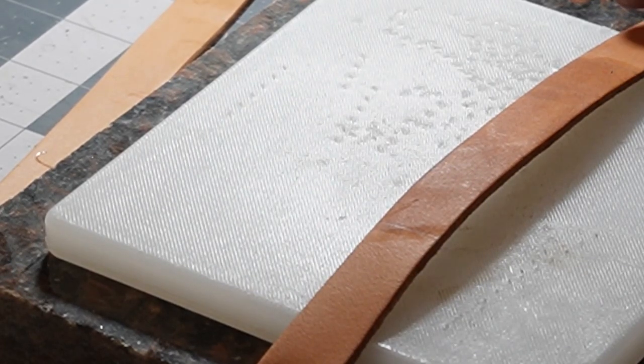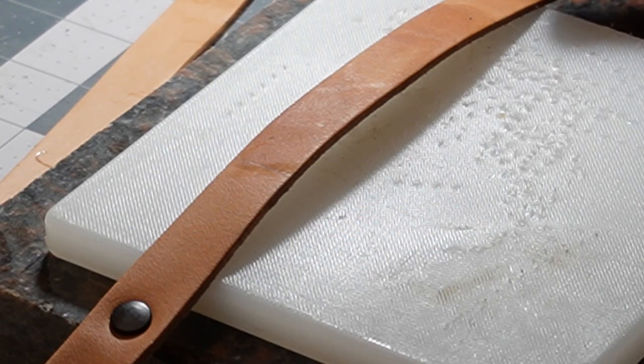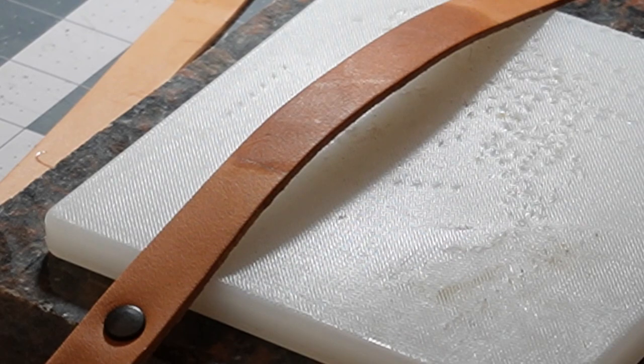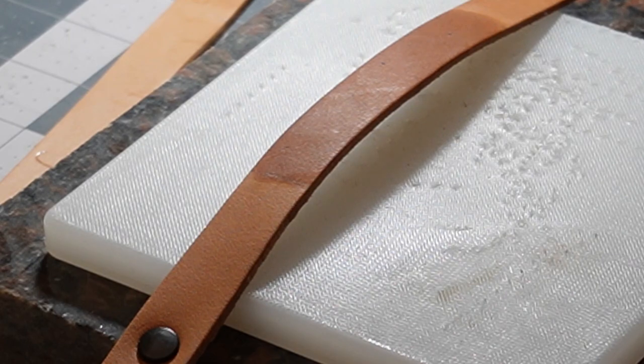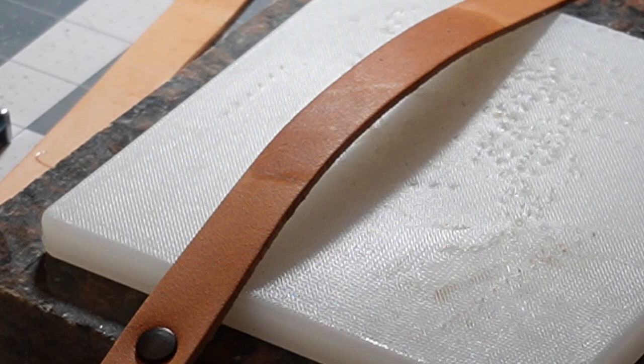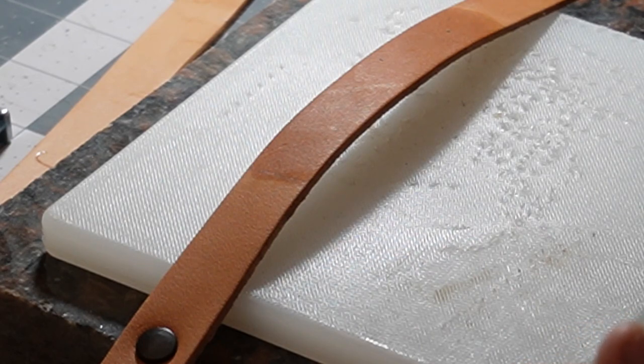You can see the leather is picking up the water and soaking it in. You have to do this a couple of times to get the leather pliable enough for stamping. We'll watch for the water to start pulling up on top — that's generally when I stop. Then we wait for it to get a little drier before we start stamping.